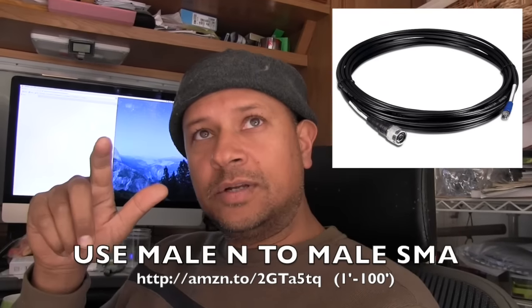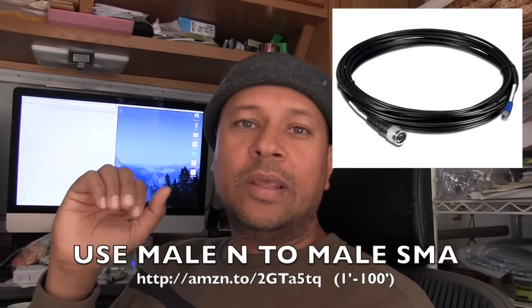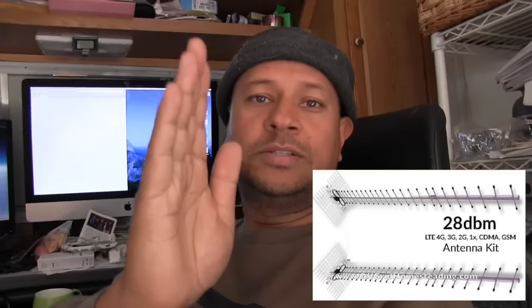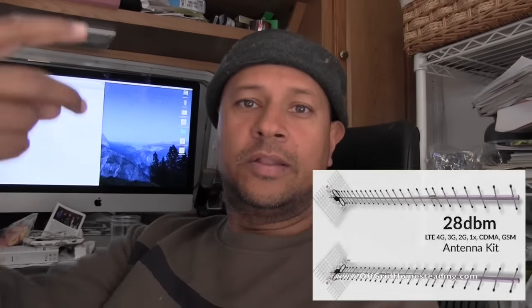It also has a number of advantages using the external port from what I've seen. If you have good signal, you don't need the WeBoost at all. You can actually go directly from the MF279 to some external antennas. From what I've read, it's a MIMO port, multi-in, multi-out. So you could go directly from an SMA male connection to a Yagi, which is directional, outside on a bar. From what I understand, the Yagis have to be 45 degrees out of phase with each other. So if you have a bar like this, you put one antenna like this, and the other one down like this. So you've got two antennas shooting at different angles, facing one direction, just south like it was in our situation. And that way you can get the MIMO functions of that router.